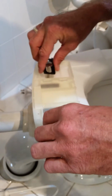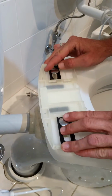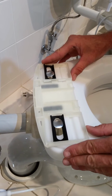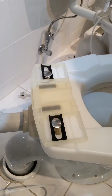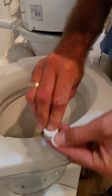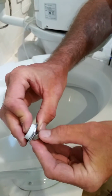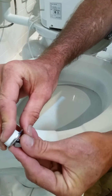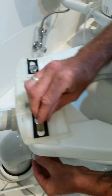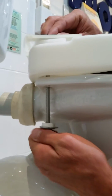Bolts through the toilet pan hole. Center up your spacer. On which way they go, I usually put the bolts that way to protect the pan, nut on last, fibre washer to help lock the nut in,